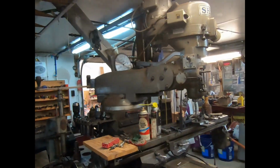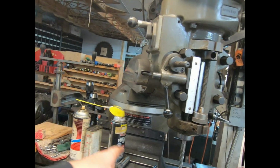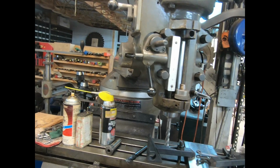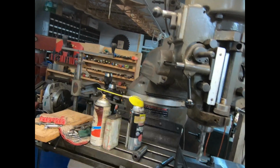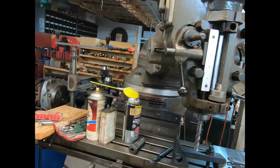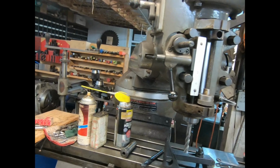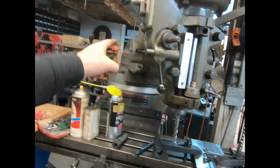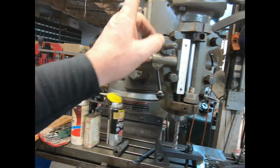to put this beast all back where it belongs, back to 0, and I've got to indicate the vise back on it, and I'll probably indicate how many degrees it's off, make sure that head isn't still turned, because that'll figure up if you go in and out. Well, no, it won't. I guess it's still, because you don't travel that when you're cutting. So yeah, I just got to get it back to where it says 0.